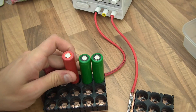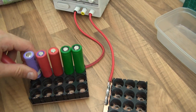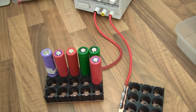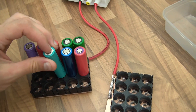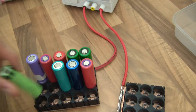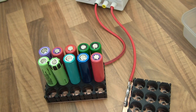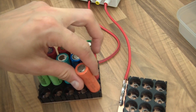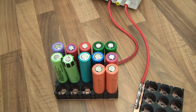The way this is designed is that you would charge 15 cells, and really it's advisable to charge 15. If you put just one in, what can happen is that it can draw the full 5 amps if its internal structure allows that. Just because you put one in and allow 5 amps doesn't mean it necessarily will take 5 amps — sometimes it can be less. From my experience, only the broken ones try and draw huge amounts of current because they seem to act like a bit of a short circuit.